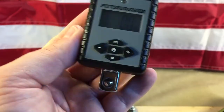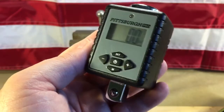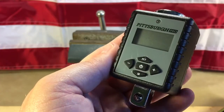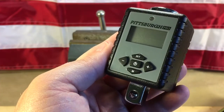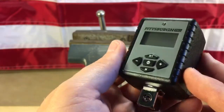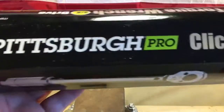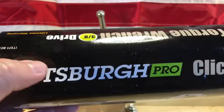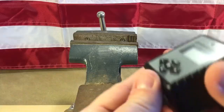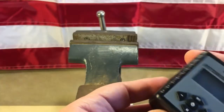I have a buddy that's got a torque calibration machine — it actually just measures torque on wrenches for his shop. And this was pretty much dead on. It was within 0.6 foot-pounds of torque as the biggest variance we had, which was pretty impressive. He was really shocked, especially since I brought up a Pittsburgh Pro half inch drive wrench. It was actually dead on — I couldn't believe it.